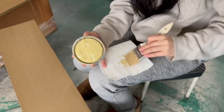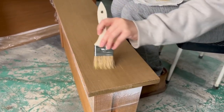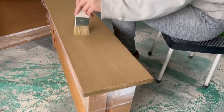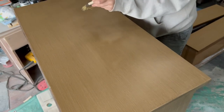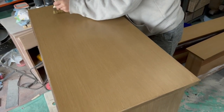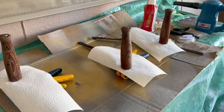So it's the next day. I'm taking a tiny bit of a light yellow paint on the ends of like four bristles of a chip brush, wiping off most of it, and then dragging it through the glaze. This will create more dimension in your finish, kind of like highlights in your hair. If you're going to do this, you want to use literally the tiniest amount, otherwise it'll start looking a little too DIY, if you know what I mean.